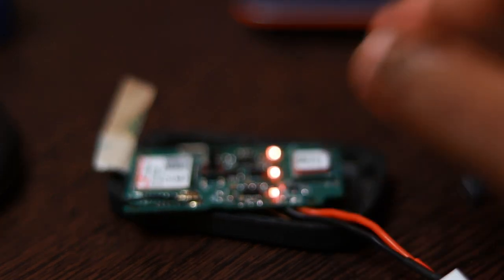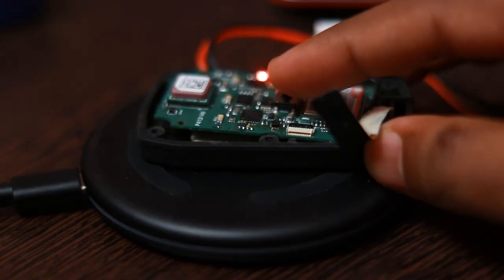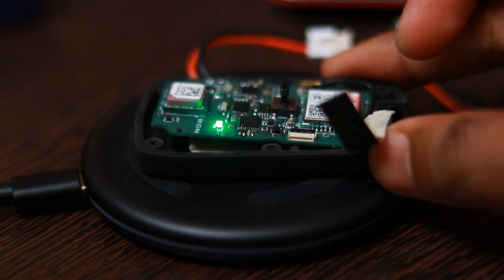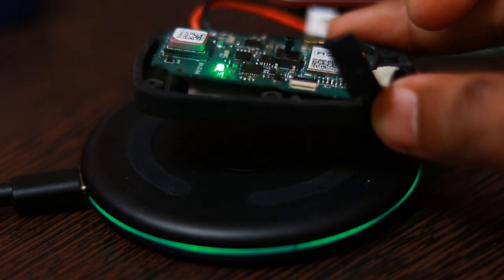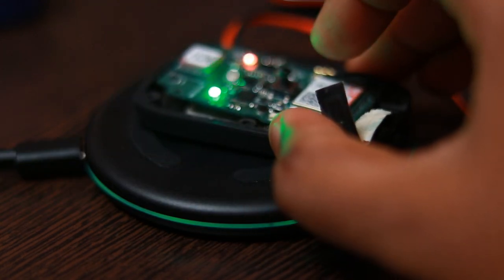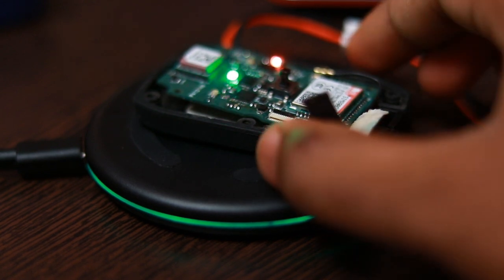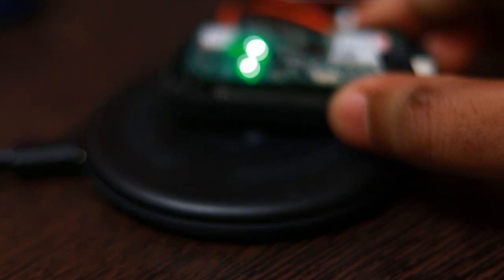The MCU also indicates low battery status using the battery RGB LED. And when the device is placed on the wireless charger, the MCU detects it as charger connected, turns off the GSM and GPS, and stays in low power mode so that the battery can be charged faster and prevent battery drain in parallel by the modules. The device works great so far and we have tested all the peripheral functions described. The wireless charger worked without any problems as it is based on the TI reference design. The RGB LED and the IO extender are also working great and have offloaded the MCU from a lot of work.